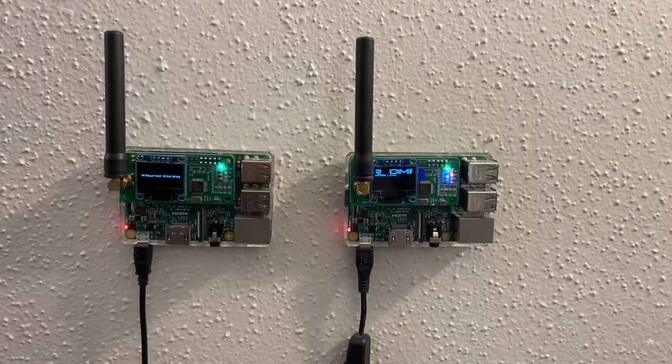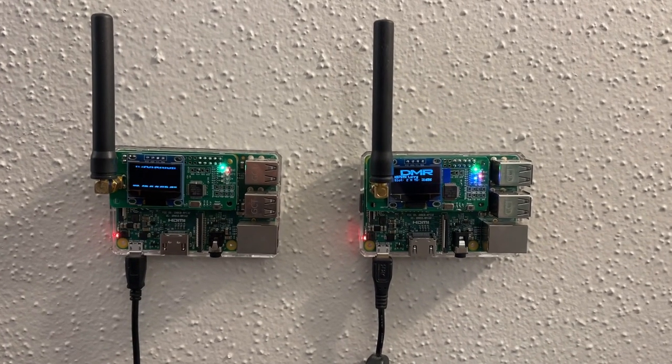So kind of hard to miss out. I got them on Amazon from a company called Bingfu. I'll leave some affiliate links in the description, but if you just search 'soft antenna' you'll find them. Yeah, I know — soft antenna. Well, they are. Most handheld radios don't have a power output less than one watt, but when I'm using a hotspot, I could go for like a tenth of a watt and it would be fine. I'm going from here to my hotspot that's 10 feet away — I don't need all this power.